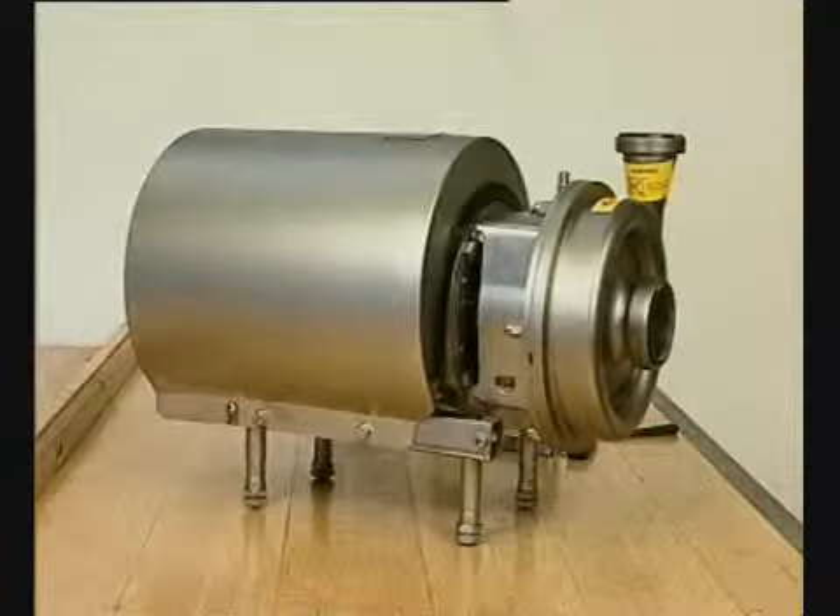The all-round LKH pump is used for pumping heavy-duty products. The pumping process is carried out by an impeller connected to a shaft which is driven by a motor. The semi-open impeller provides unobstructed product flow into the impeller, which gives low NPSH requirements. The parts surrounding the impeller are all designed for gentle product treatment at high capacities.